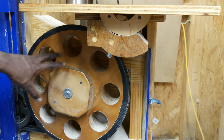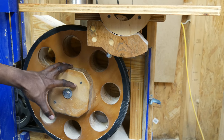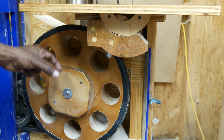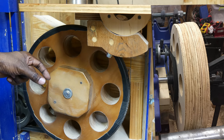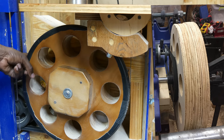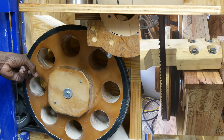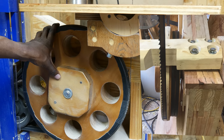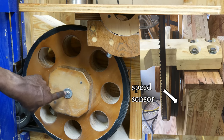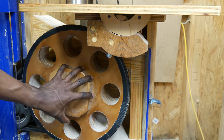Looking at the lower compartment, you can see my drive wheel. This has two extra layers of three-quarter-inch plywood on the back where I turned the two pulleys, because I needed two belts to handle the horsepower from the motor. So it's extra thick, but otherwise it's made like the top wheel — it's got needle bearings inside encased in the wood.